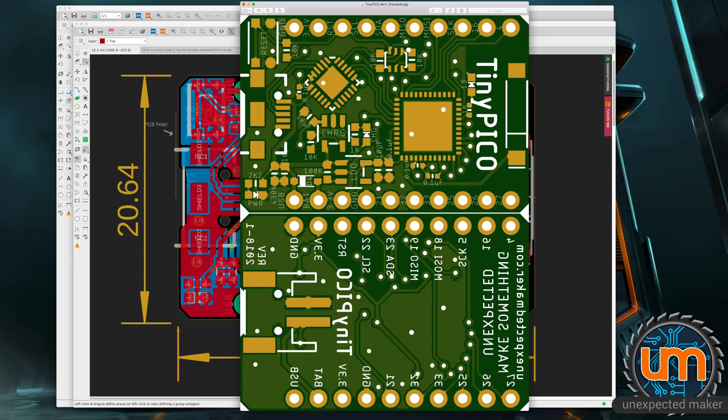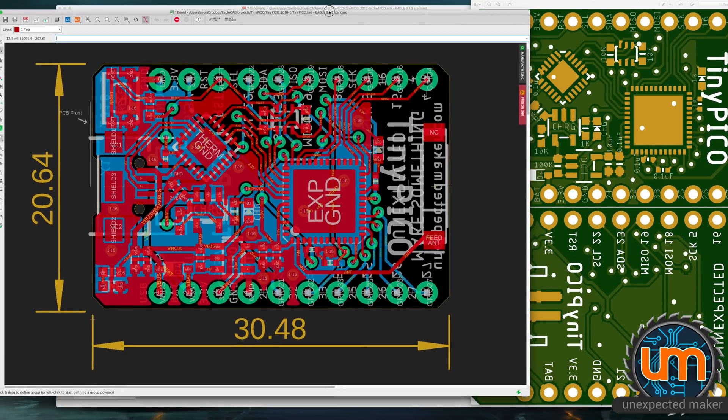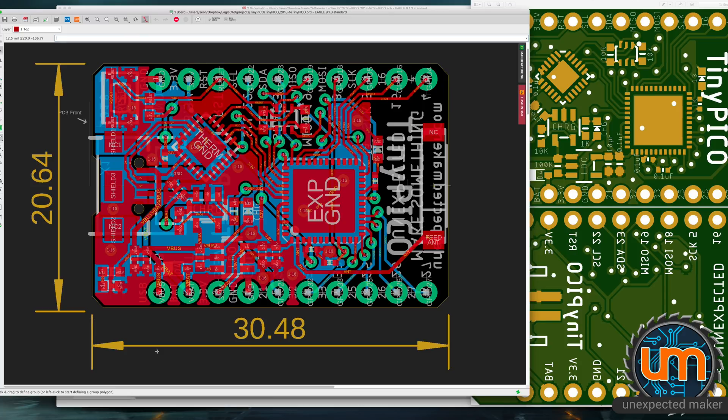This version has been sent off to JLCPCB. I'll have that and all the parts delivered to me hopefully by the end of this week, and I'll either have a chance to try to build one on the weekend or leave it for my stream. I don't believe I'll be able to build this on my live stream without my magnifying glass. But that's it — this is my Tiny Pico ESP32 Pico D4 board. It's just over 20 by 30 millimeters, with 13 GPIO broken out, built-in LiPo battery charging support, a ceramic antenna, and everything you need to do full Wi-Fi and Bluetooth. If there was ever a need for a pick-and-place for me in my office, this might be it. And a microscope.